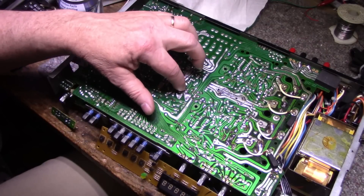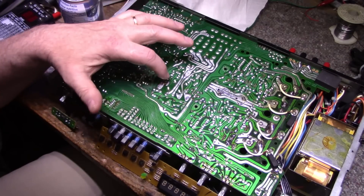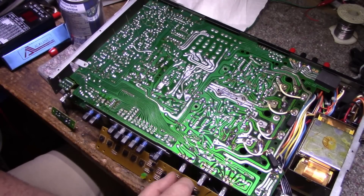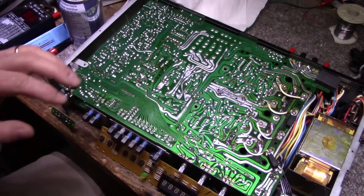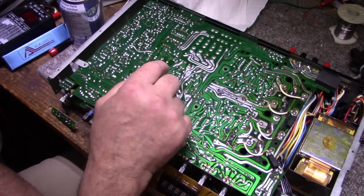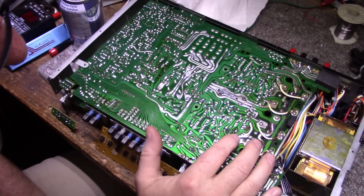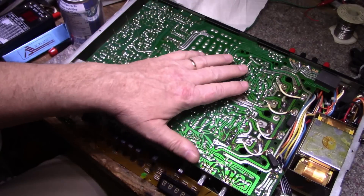There are a lot of garbage joints on here — a lot of them are cracked. Cracking is from thermal cycling: when you wave solder and don't have enough solder on the joint, you get a weak joint. Then thermal cycling — expansion and contraction of different materials — puts stress on that joint and cracks it. I'm going to rework this whole board, remove the wires, cut all the little wires sticking up from the capacitors, clean it, and reflow this board. A lot of it is blobbed with rosin flux so you can't inspect it.